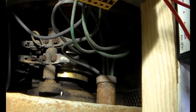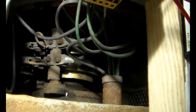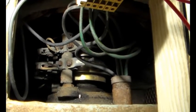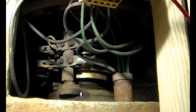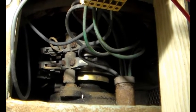You can see both of them now. I'll remove those and bring some wires out and connect them. But first of all, before I do that, I've got to flash the rotor, or those slip rings, with 12 volts and mark the polarity.